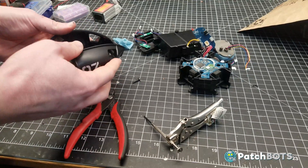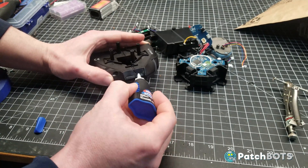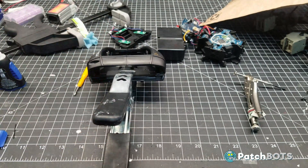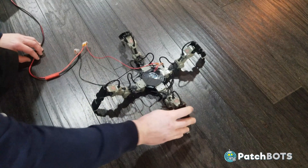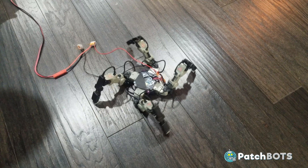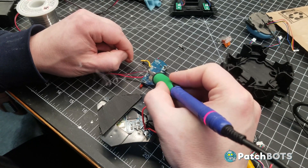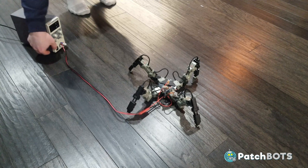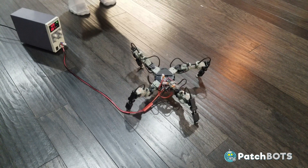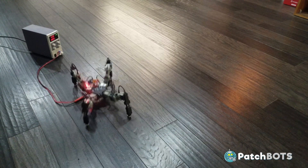Before making the cuts I secured the two pieces together in the correct position — screwed the original screws back in and glued the seam. I also grabbed a scrap piece of plastic to make a shim to hold the two pieces together. Then I used a band saw to cut out the shape and reassembled the droid with just the main board wired directly into my DC power supply running six volts. And when I plugged it in — that confirmed my fear about all the necessary signals needing to come from that battery board. So I quickly resoldered that board back on, connected the JST connections between the boards, and success! The droid booted up normally and works as it should with the remote control.